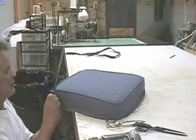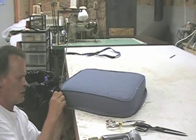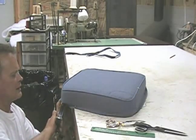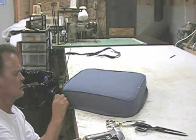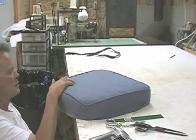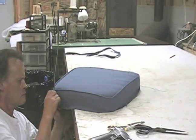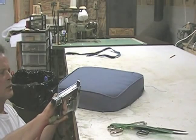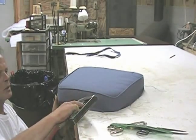Then what I do is I just put it in the corners and I'm pulling it to two and a half inches to the top of the welt. I put in a stay tack. What I mean by a stay tack is I'm taking the staple gun and kind of tipping it, pulling it to the side so only one tongue of the staple goes in to hold it, because I intend on pulling it back out.